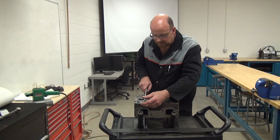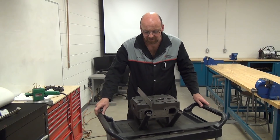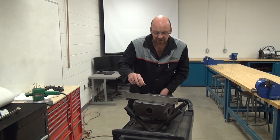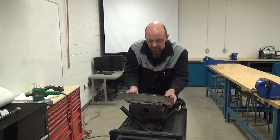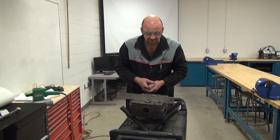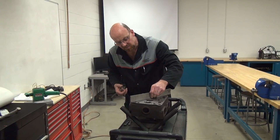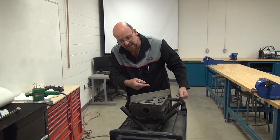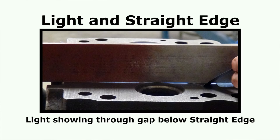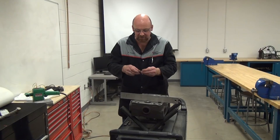If we are going to check and look for dimensions here — and there was one that I found — I can hear it. So if I can hear that, I know that there is a value there. We're going to look at this with a light that can come in behind it. The way I used to do this in the trade — and it's a really good one for technicians to understand — is that if you put a light in behind the straight edge and you see light, there is a measurement there that you're going to have to find and determine if it's within manufacturer spec or not.